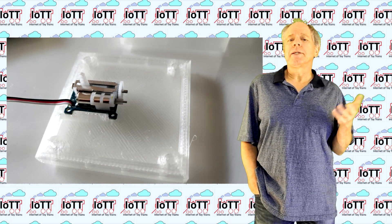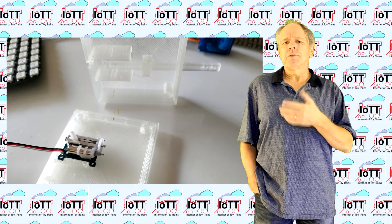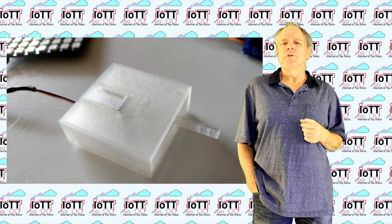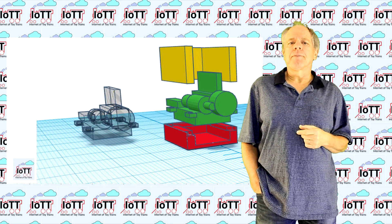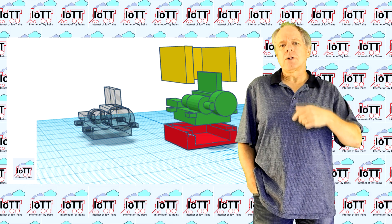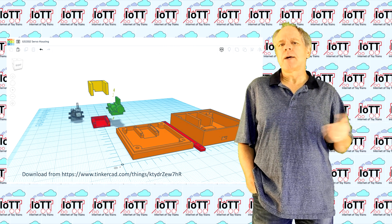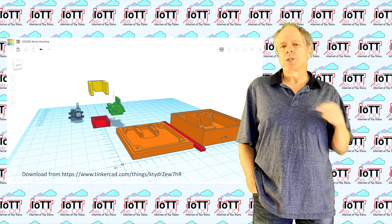As part of my testing, I also did a quick-and-dirty 3D printed enclosure for the servo. It is rather big — about 45 by 45 mm — as I thought to use it as a replacement for the G-scale turnout motors from some LGB turnouts, but that was before I measured the pulling force. If you have your own projects using the GS1502 servo, you might be interested. I did a model of the servo device itself along with the support and hold-down structure. Those design elements are separate in the file so you can make a box of the size you like and put the structural elements into it for a customized housing. You can download the STL file from Tinkercad using the link in the video description.